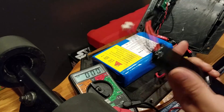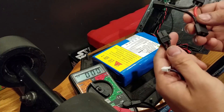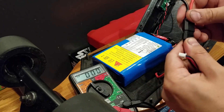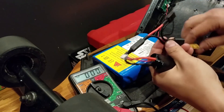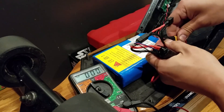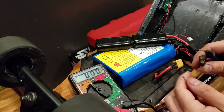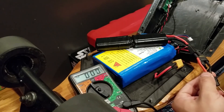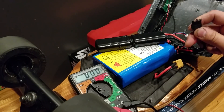So I made these components here to test and make sure that the board will work with the 12s configuration. Essentially I plug in to the 10s battery and now I should be able to get — I believe it's 50 volts — there it is, 50 volts. So yeah, that's a 12s worth of LiPo power coming out of this connector right here.